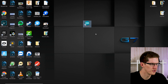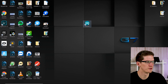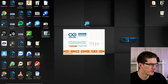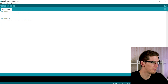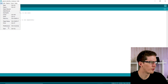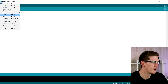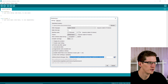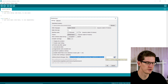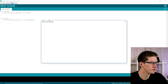If you haven't used Arduino before, don't be intimidated — it's really simple. You're going to need the Arduino IDE; I'll leave a link below where you can download it. If you're using a Wemos D1 board, you'll need to download the boards manager for that board. Go to File > Preferences, and where it says Additional Board Manager URLs, enter the URL — which will also be in the description below.